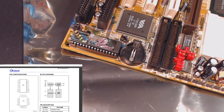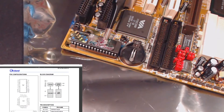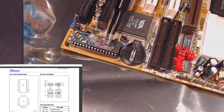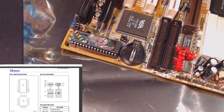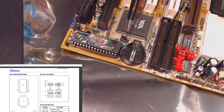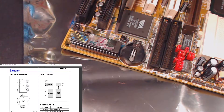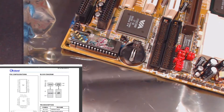I still believe there's a chance we can post with this chip — just because the EEPROM programmer wasn't detecting it doesn't mean it won't post, since it's more tightly seated in the board socket than in the ZIF socket. But if we can't post, this chip is our first suspect, because the corrosion around this area was pretty extensive and highly localized, requiring trace repair and component replacement. Until I can't post with this chip, I won't write it off.